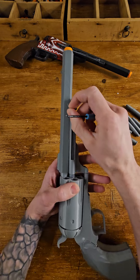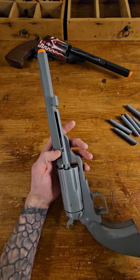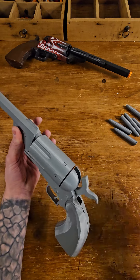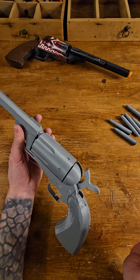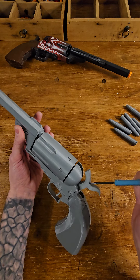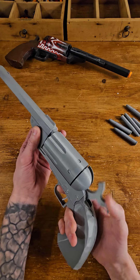It locks down here at the end - in this place it locks down. But if you forget to lock it, or in a hurry you fail to lock it down, it falls inside the cylinder where the bullets are. When you try to pull the hammer, after the first click it won't go further. If you keep applying pressure, the small bits inside that make the hammer, trigger, and cylinder combination work will break, and that combination will be broken.